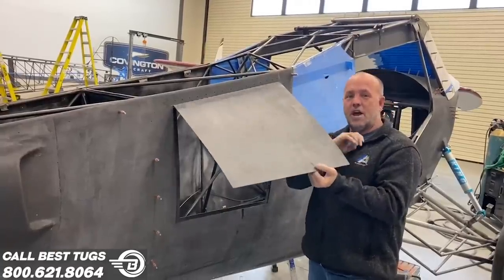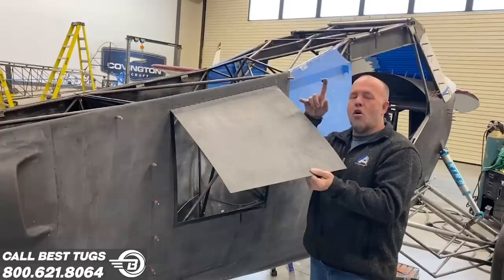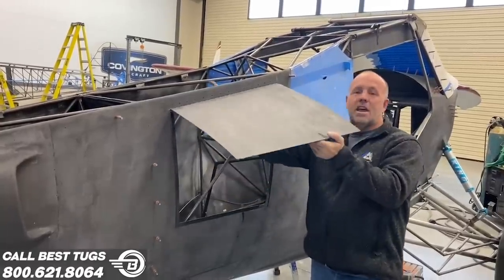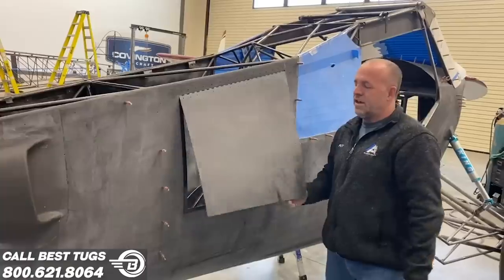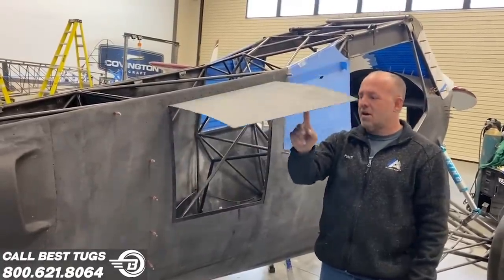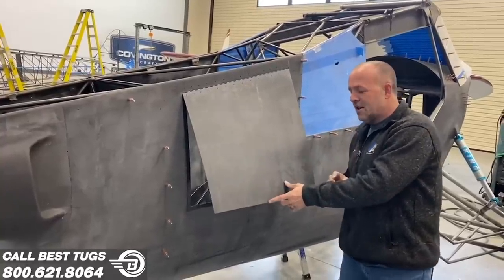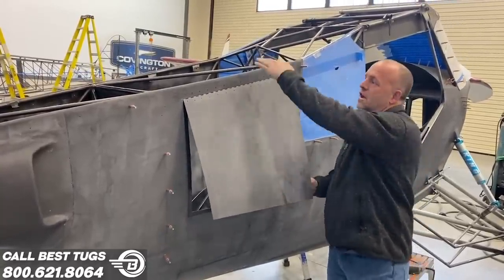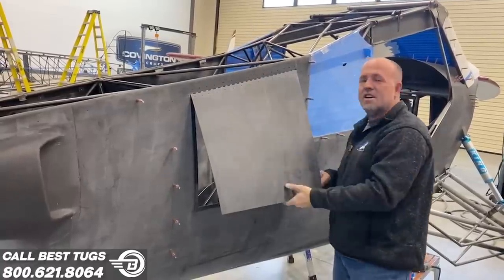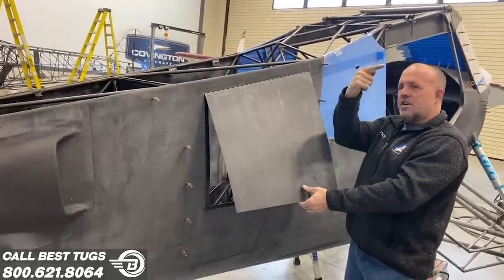I want the strut to have a dual purpose. So I'm gonna change the over center pivot moment of the strut on the way I build the overlapping hinge connection point, so that when I get here, the strut pushes the door open and holds it for me. And when I get to here, it transitions to neutral with the same strut. And as I go further, the strut connection point pivots into the other side of the hinge point on the hinge.